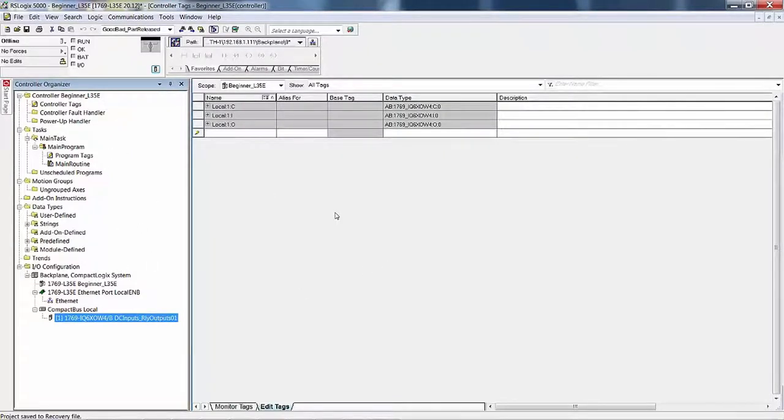You're on page 176, 177 in your project manual. And in there, I do point out again that the main task is a continuous task indicated by the clockwise rotating arrow on the folder. It means it is continually trying to execute. The main program is a program indicated by the symbol on its folder. See the symbol right there? Looks like a little flow diagram. That indicates that it's a program,